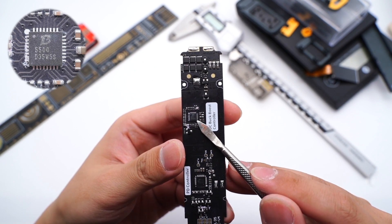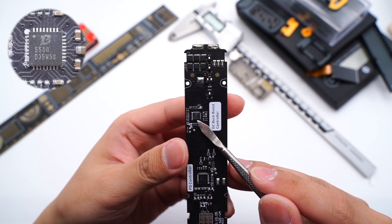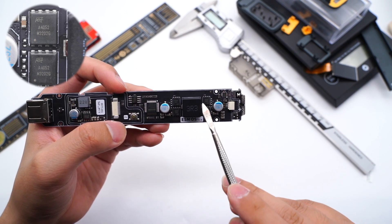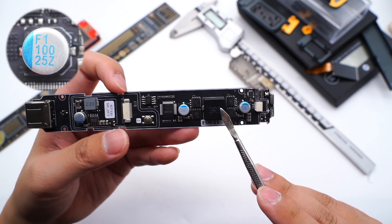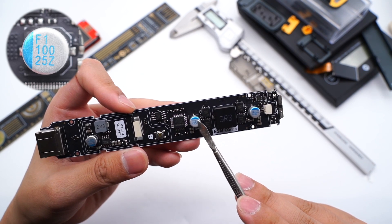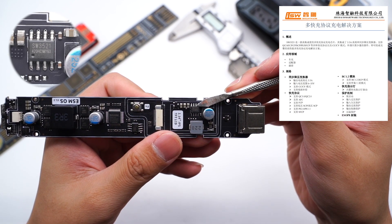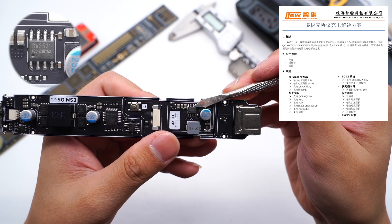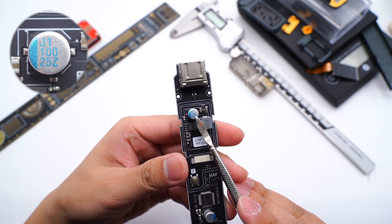The PL5500 integrates 5V 55mA LDO and multiple protections. It also supports wide input voltage of 3.5-32V, output voltage of 2-32V, and different working modes. Those four MOSFETs come from FEDEC FKBA4052, and can work with Polycan PL5500 to buck and boost: 40V, 8.5mΩ. This huge Qubit 3R3 buck-boost inductor and another solid capacitor are used for USB-C filtering: 25V 100μF. The step-down protocol IC of USB-A comes from iSmartware SW3521, which integrates a 3.5A high-efficiency synchronous step-down converter and supports multiple fast-charging protocols and CC-CV modes. Here is the 220 step-down inductor. This final solid capacitor is used for the output filtering of USB-A: 25V 100μF.